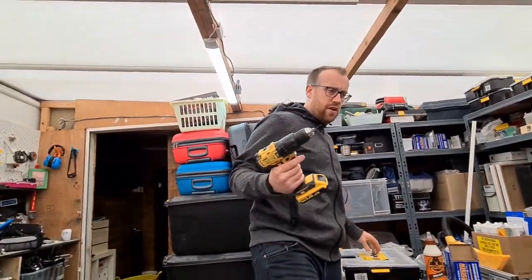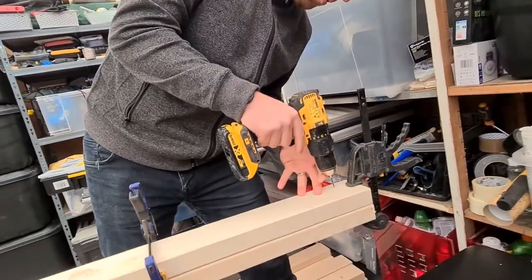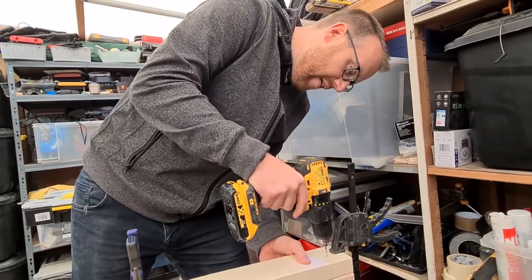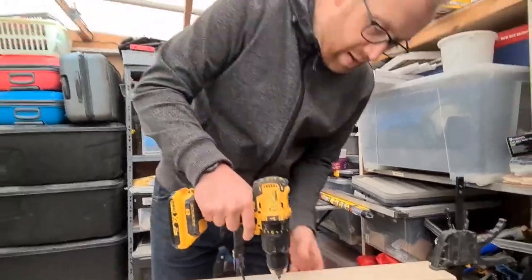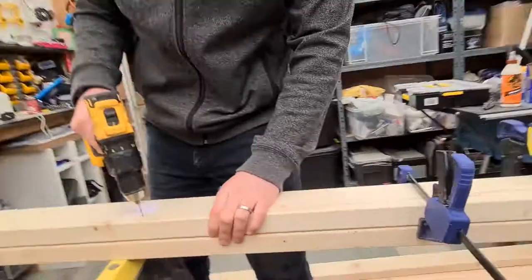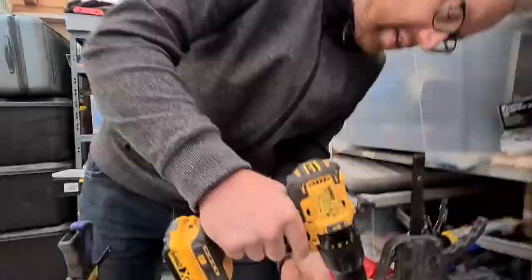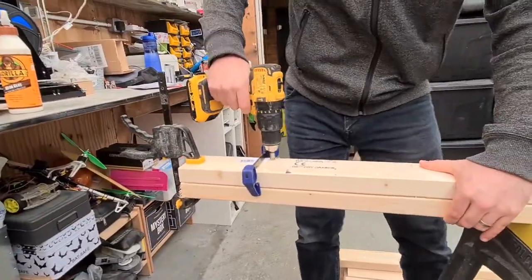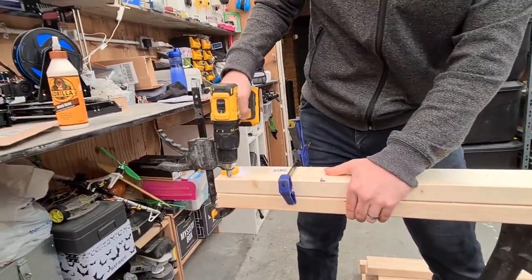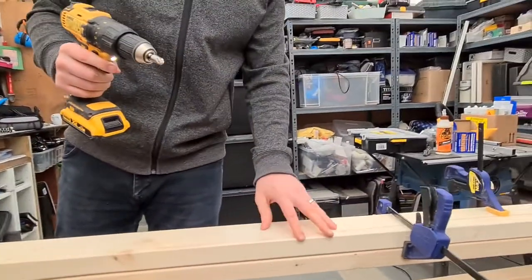So what we'll do now is, if you want to follow me down, Oliver, we'll just do a couple of pilot holes. The one there. And we'll just do it maybe every 30 centimetres or so, all the way down. Last two at the end. And there we go. So in a minute, we'll get the screws and drive those in.